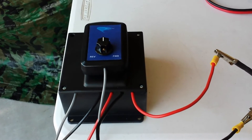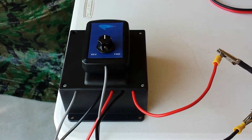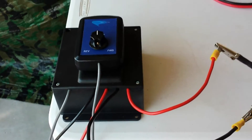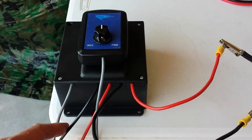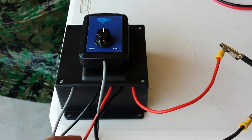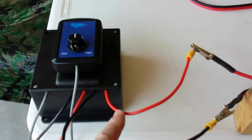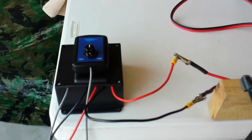This is a close up of the handheld controller and the sending unit. You can see the gray wire coming out of the handheld controller and the gray wire going into the sending unit. The first black wire is going to be connected to the negative of the trolling motor, the first red to the positive of the trolling motor, this black to the negative of the battery, and this red to the positive of the battery. That's how simple this setup is.